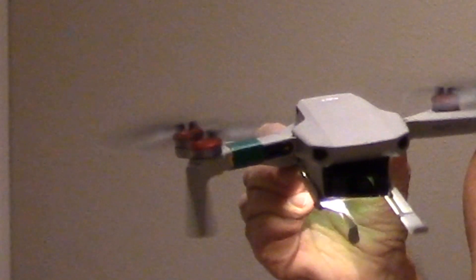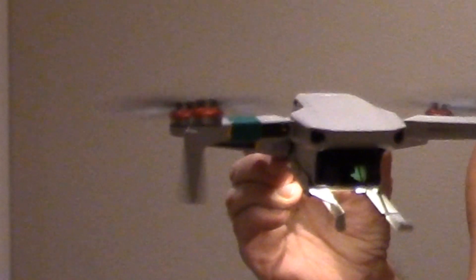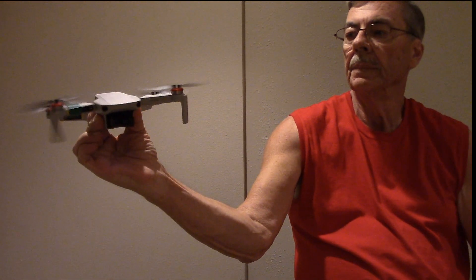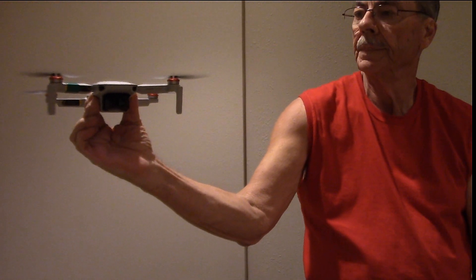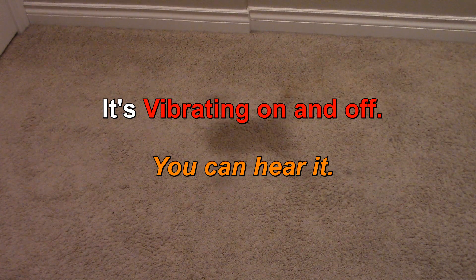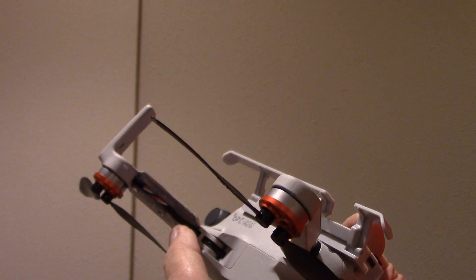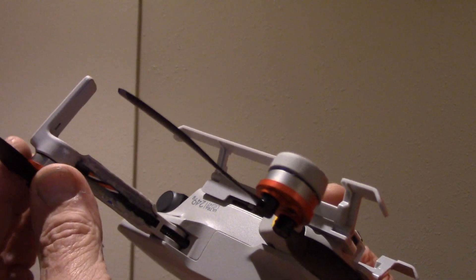If you notice, the left side, which has been stiffened, is vibrating badly from some harmonic phenomenon. This arm also has more mass as it holds the added weight of the antenna leg, which is vibrating badly. With me adding some side forces simulating wind gusts and hard maneuvers, this shows the right leg begin vibrating — and when it does, the drone becomes vulnerable. I've taken that back out now because it was vibrating — it was really causing this to vibrate. I think that flexing must have something to do with the dampening, because it's smooth now.